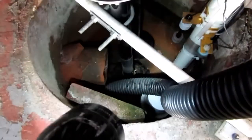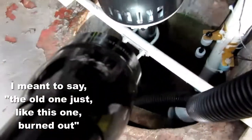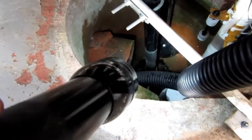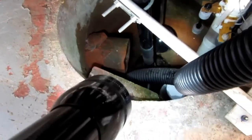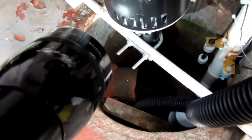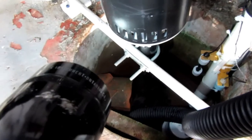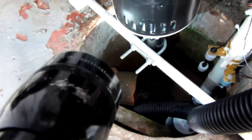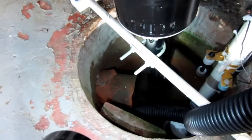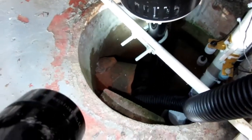I've got a pedestal pump in here right now. This one burned out during the big flood — I was desperate to get whatever I could get my hands on, and this was all that was left. The old one was a pedestal pump too, but I came to realize the motor burned out because it was running full out and the thermal protection didn't work for some reason. So it failed — the pump itself was okay, just the motor burned out.